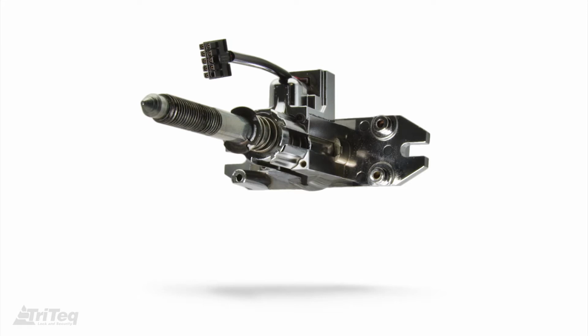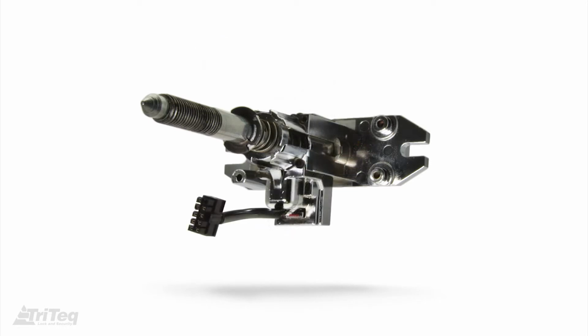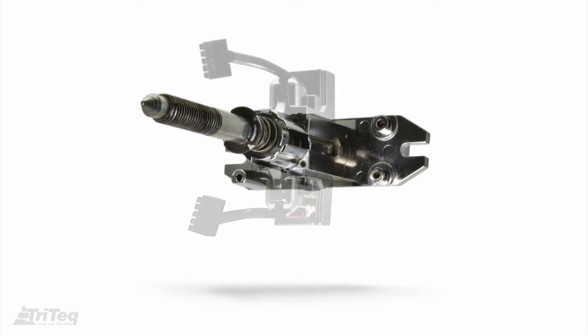To provide flexibility in mounting, the latch module is capable of sliding onto and mounting to the housing in 3 different positions on the housing. For example, when the T-handle is mounted horizontally to a door, the latch housing can be mounted at the 12 o'clock, 3 o'clock, or 6 o'clock positions. At least one of these mounting positions will be available and should be chosen such that the latch module will not interfere with any component surrounding the T-handle in your machine.